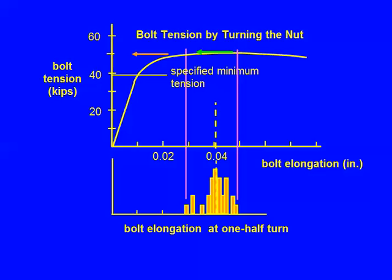The proof of all of this — what we're looking for — is what's the bolt pretension? What's the pretension in the bolt that's least elongated? About 50 units? What's the pretension in the most elongated bolt? Pick a number, 49.8 or something.